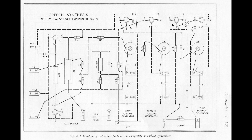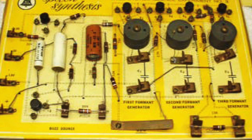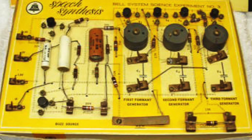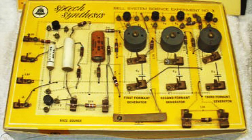In this kit there was no protoboard — you actually built the circuit itself on top of the box that the thing came in. There's essentially a sketch of the components on the box, and you would put in clips for the capacitors you want to swap out to change the frequencies, poking the leads through the box and soldering underneath. This may be one reason why my original prototype only lasted a year or two — it's pretty fragile.